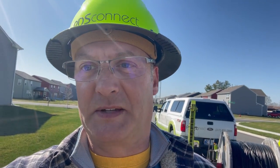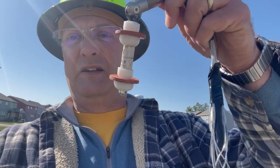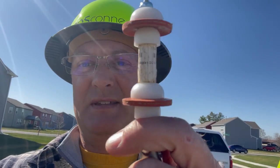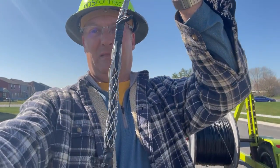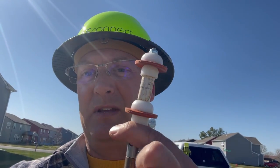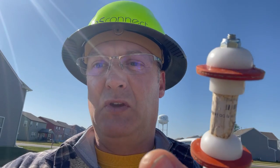So now we've got the sponge all the way at the other end. Here's how this works: there's this little shuttle that basically has these little o-ring looking pieces — they act as squeegees. We're going to add some more lube into the pipe, put this in there, and on the back side we have a swivel and then a pulling eye onto the fiber. We're going to use low pressure — about 15-20 psi — because this is microfiber and we don't want to damage it or put too much stress on it. That way on the back side it's actually pulling the fiber through the duct. And then inside the unit there are what look like tank treads, and those tank treads will force the fiber down the duct. So you have pulling force and you have pushing force. This 3,000-foot run will probably take a couple of minutes end to end.